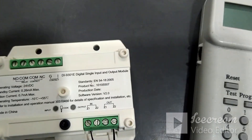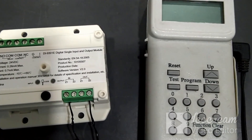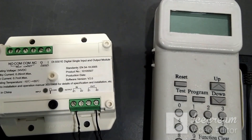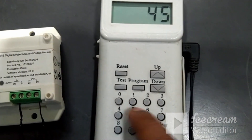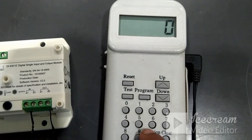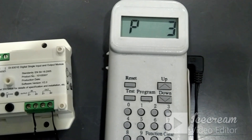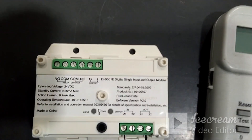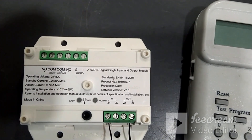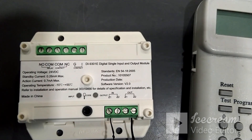Addressing can be easily programmed, but when we use this module we need to change its mode. To change this mode so it works trouble-free, from the programmer press 4, 5, 6, Clear, then Function 3, press 3, and then Program. This will put it into non-checking mode. Non-checking mode means normally this module monitors some voltage on the Common NO or Common NC terminal, so if you don't change the programming as described, you will get an error.